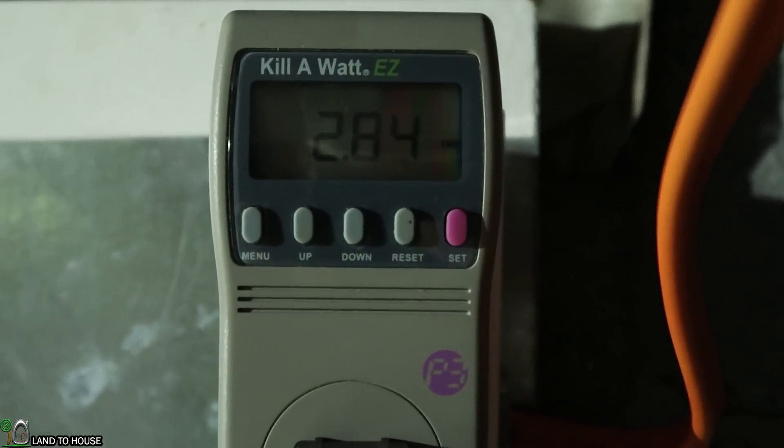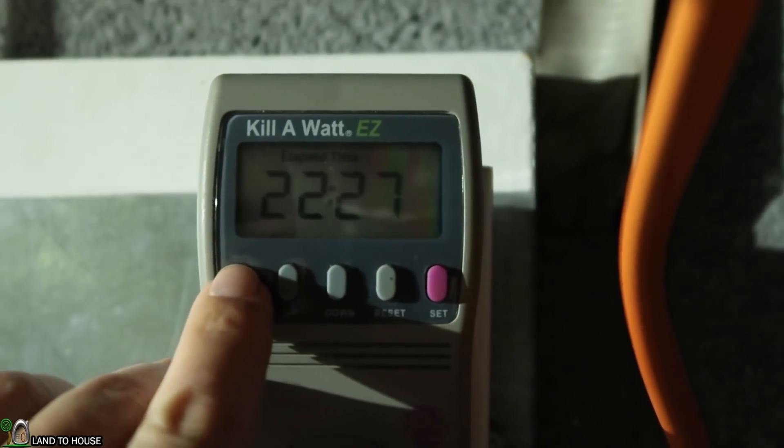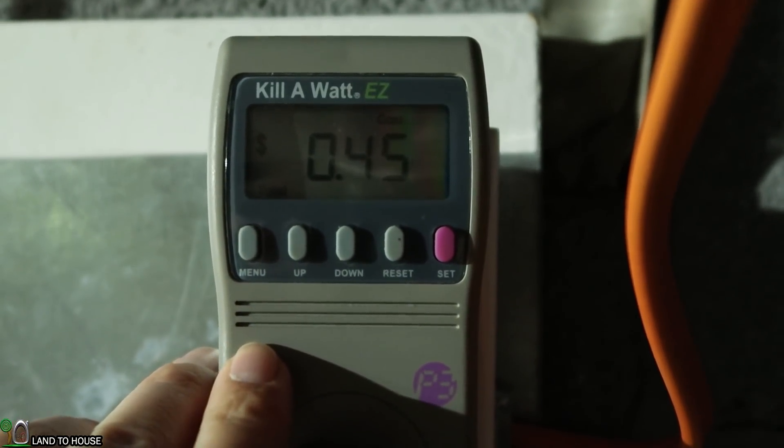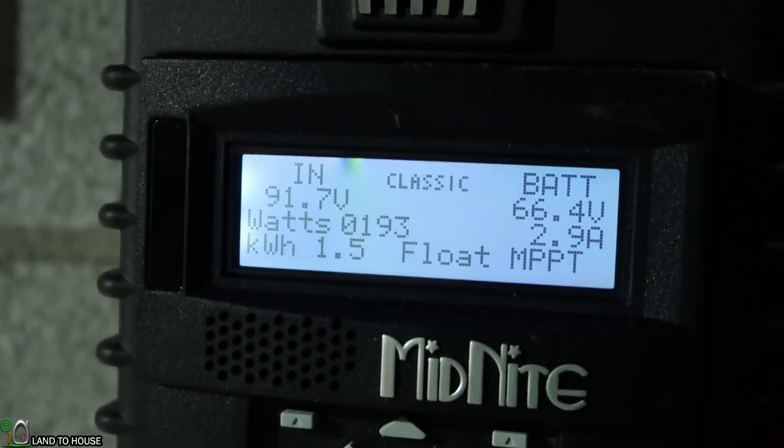It's the next day now and I want to see what is displayed on the kilowatt meter here. We have currently used 2.84 kilowatt hours since yesterday. It's been 22 hours and 27 minutes, and we've saved 45 cents in 22 hours. Looks like we are currently in float at 193 watts, which is pretty awesome. The highest I've seen the charge controller jump up to with one nozzle going is 199 watts, which is better than I was expecting. As you can see, the kilowatt meter has allowed me to see how much power is being pushed back into the house, and also the cost, just by clicking a couple of buttons.